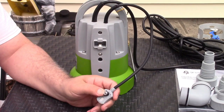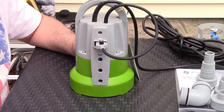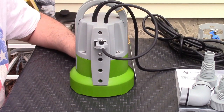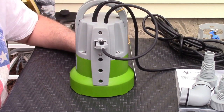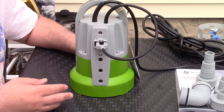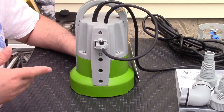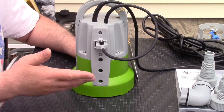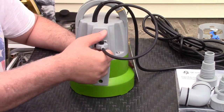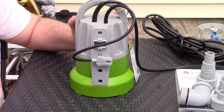You don't want to run these pumps dry. In manual mode, don't plug it in and leave — if it runs out of water, you'll burn it out. If you're upstairs and hear it start sucking air, you've got about a minute to get down and unplug it. It's not going to blow up right away, but the point is: don't run the pumps dry.